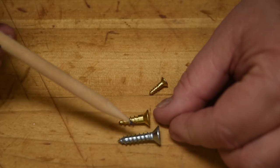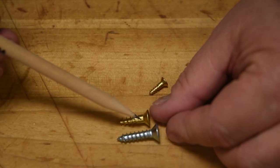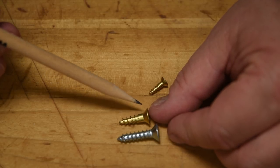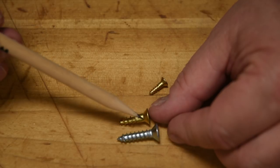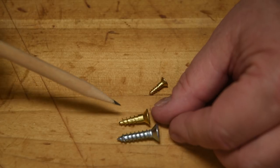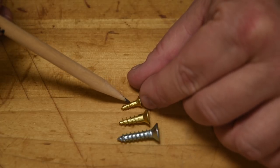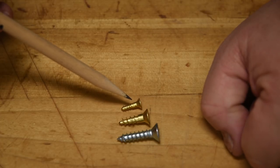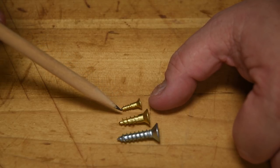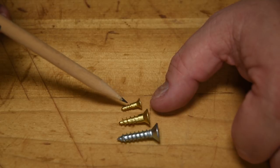These more modern ones are cheaper to manufacture. Also, if you look at this angle, most of these are set at 45 degrees. I believe these are a tad bit steeper than 45 so that if you create a recess for them to sit on, they will actually touch on the top and get a tighter fit. They put a lot of thought into these screws. The same characteristics go even on the smaller ones - the shank is as wide as all the threads, the threads get steeper the deeper they go, and the center section tapers.